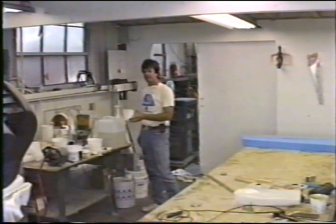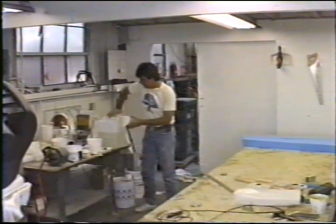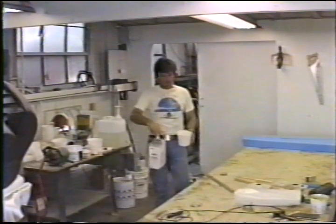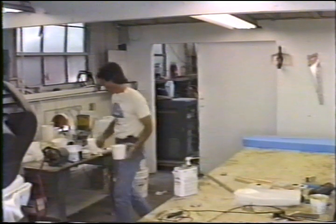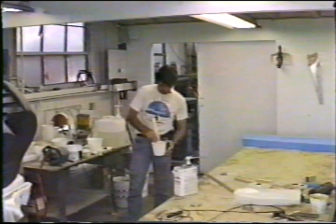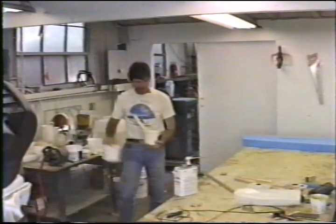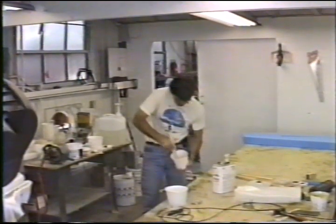Now that we have the trailing edge sanded, we're going to mix up two shots of West Systems resin. There's one. There's two. Don't let anyone interrupt you while you're doing this. Now that you've got 2 shots of resin, we have one hardener. Mix well. We're going to mix this to a dry consistency. See the resin on the inside.